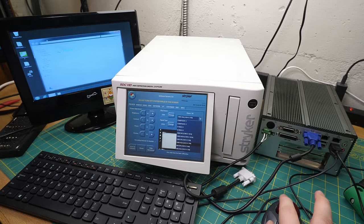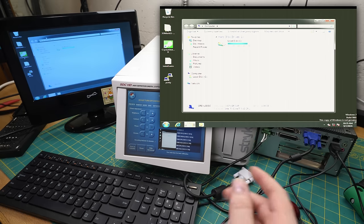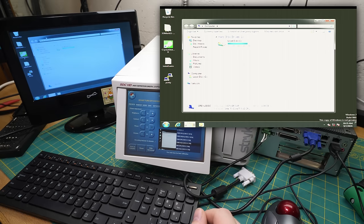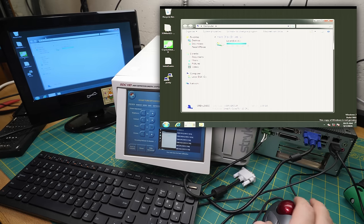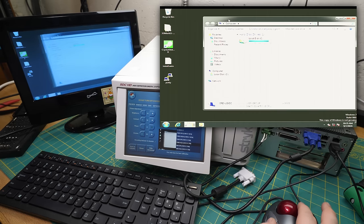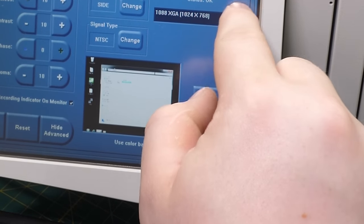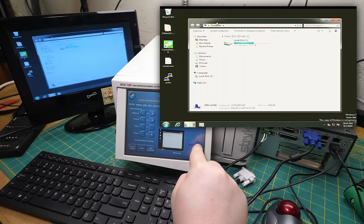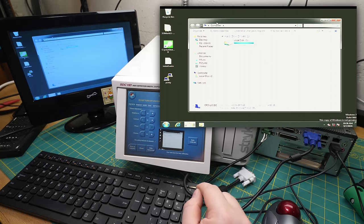However, it doesn't look very good. You should be seeing the raw capture now and yeah, it's just all low-contrast and blown out. It's got streaks across it - clearly some low-quality analog-digital conversion is going on here. I already tried messing with the picture adjustments and nothing seems to make any difference. I'm kind of wondering if this thing has just fallen out of calibration. Actually, now that I think of it, there's an auto-calibrate button here. What happens if I hit it - well, that already looks a little bit better.